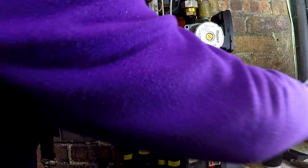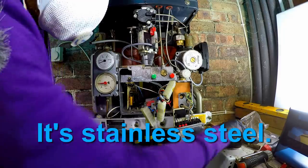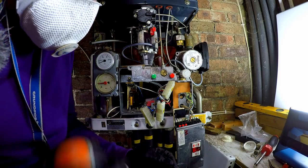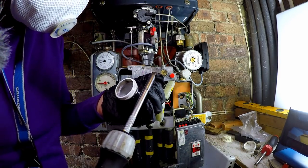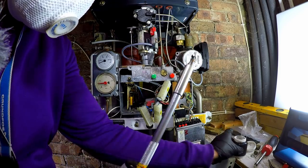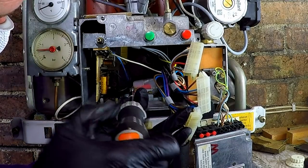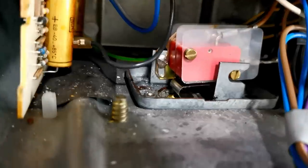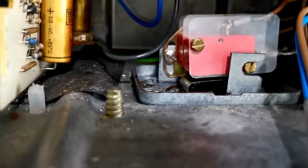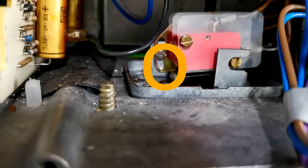Okay, let's get this in — this tiny little screw wants to fall off my screwdriver. So I dip my screwdriver in grease and put it on there — now it won't go anywhere. Got that back in there. You can see where that point lines up with the scratch I made previously, so we know that micro switch is in the right place.